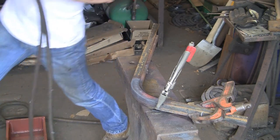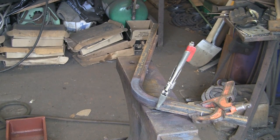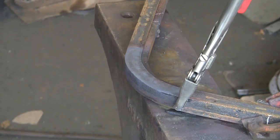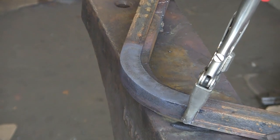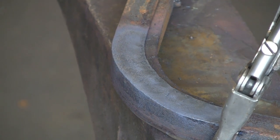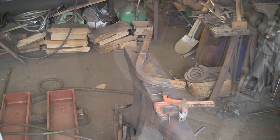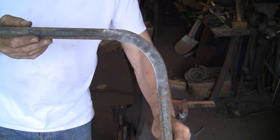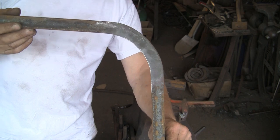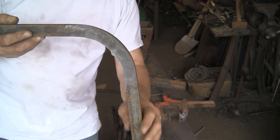Now for the job I have in mind — obviously if I was doing dozens and dozens of these, I would have just sent a template to my local ring rollers and they would have done them spot on. But as I only want a pair, it's not worth it — it's just easier to make a little jig up. I'll sling that in the corner of the shop; you never know, in another 20 years' time I might want to make some more. As you can see, that's not too bad. By the time that's all clad with sheet — I don't know if he's going to use steel or aluminium — that won't look too bad at all. So I've just cleaned it up a little bit, just the inner edge, because the inner edge does get a bit puckered. I've just run a file over it to tidy it up, and by the time it's clad around here that'll look quite nice.